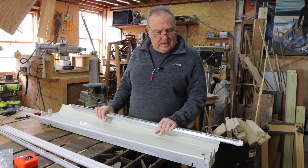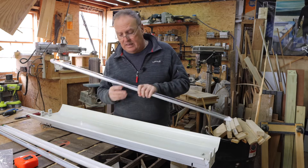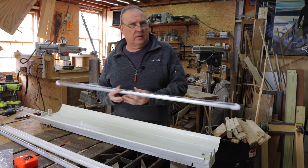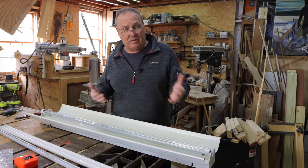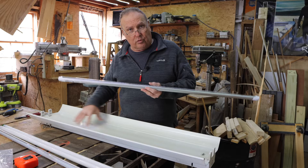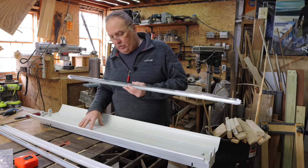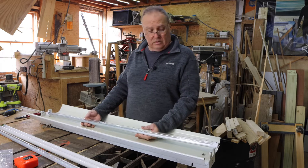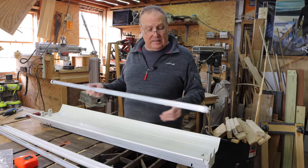What I want to do today is replace these bulbs with LED T8s. There are two types: Type A is a direct replacement — it can coexist with the ballast and has an internal regulator that essentially ignores the ballast. That's your easiest upgrade path. Type B requires removal of the ballast inside the unit. Since the ballast is a transformer of sorts, I want to remove it for efficiency, so I'm going with Type B bulbs, which will not use the ballast.